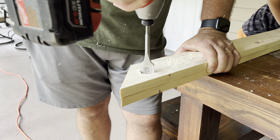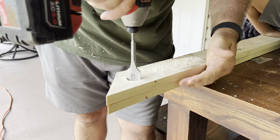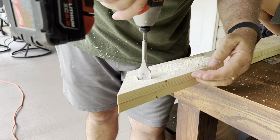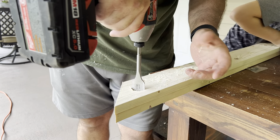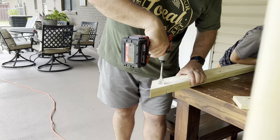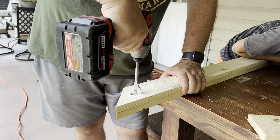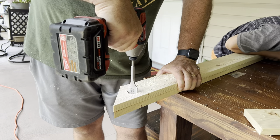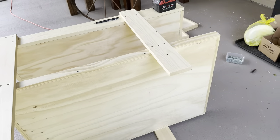These are the sides for our main shelf, made longer than the shelf itself because we want it to come out. We're going to sand it down and put a handle through here using a dowel rod. While we've got these loose we're going ahead and drilling the holes so that they match up easily.